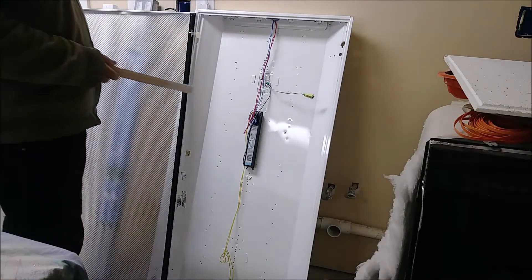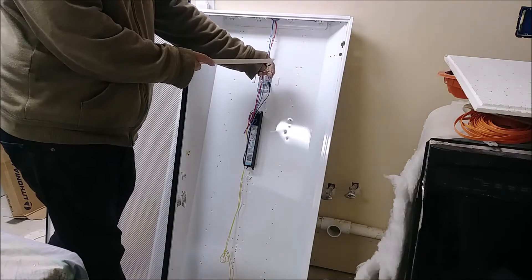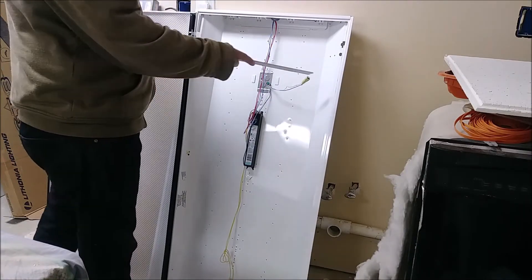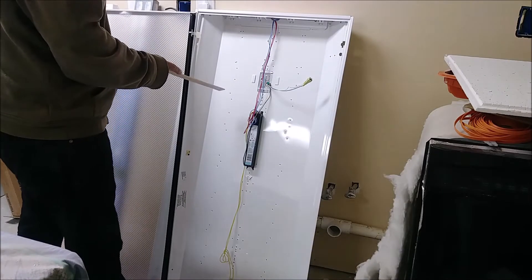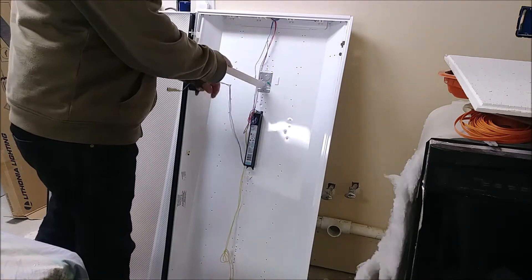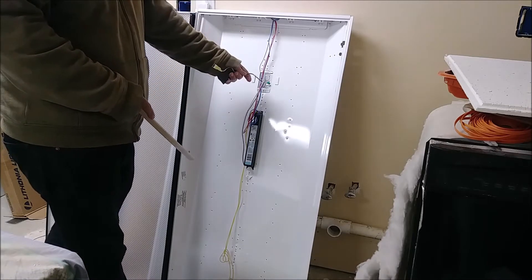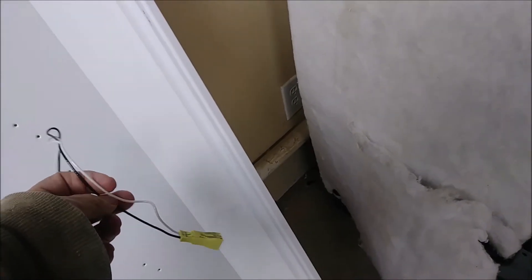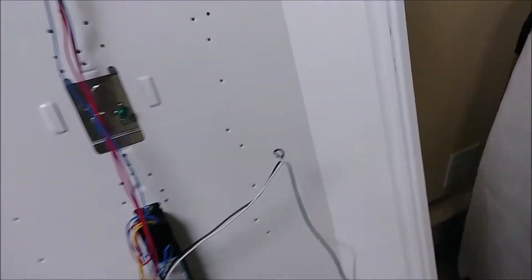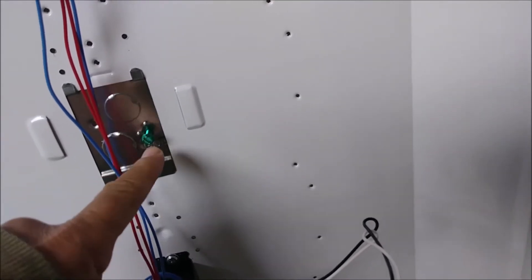Inside you have a ballast, and you have the input — that is the neutral and hot. I'm going to connect the neutral and hot to the source. Here is the ground screw — that's the screw that you should actually ground with a piece of metal to the ground. Close up, you can see a black wire which is the hot, a white which is neutral, and this is the input. And here, as you can see, is the ground, which means you need to connect the ground that comes from the source to this screw.